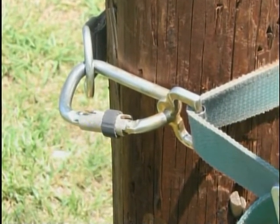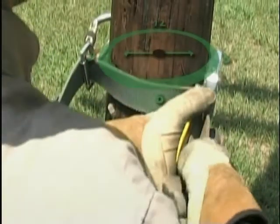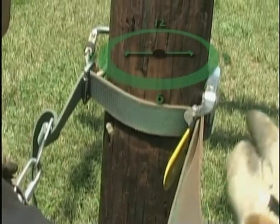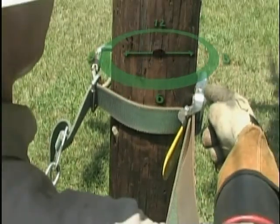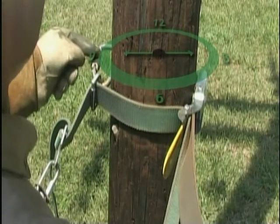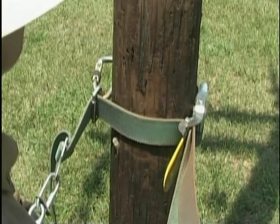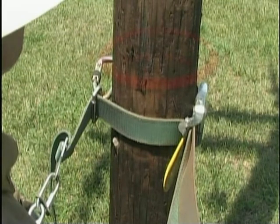See the circumference of the pole as you might view the face of a clock. For right-handed climbers, place the hinged end of the carabiner connector gate at the 3 o'clock position on the right side of the pole and the cam buckle bolt at the 9 o'clock position on the opposite side. Left-handed climbers would reverse this process. It's important that you never allow the hardware locators to fall within the 4 o'clock and 8 o'clock positions, as the strap's holding power may be diminished.